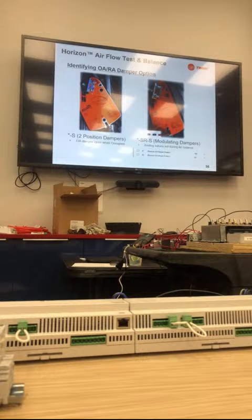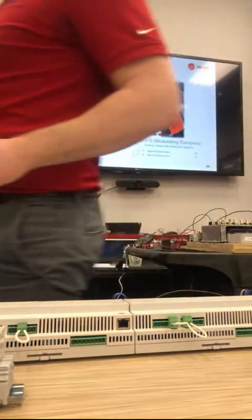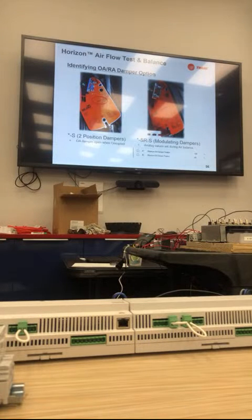Part of what caused this is there was a creep over time to go to this, because this is easy to install on the manufacturing side since you can just pop it into place, and over time it transformed into that versus this being a little more difficult. This happened over time and got worse until it got reported to us in the field, and then we found out this is what was happening in the plant. We're trying to revert back to a more secure mount, so that the actuator is not torquing itself and popping off the shaft.